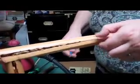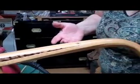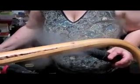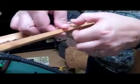So as you can see, that spline comes out. Yeah, I'd say it's definitely hide glue because of the way it smells and the way it's sticky. And once this goes back in, we don't want to use a whole lot of glue. Hide glue is still probably the best choice because 50 years from now, 40 years from now, when this is going to be restored again, we hope the next person will be able to get the spline out as well.